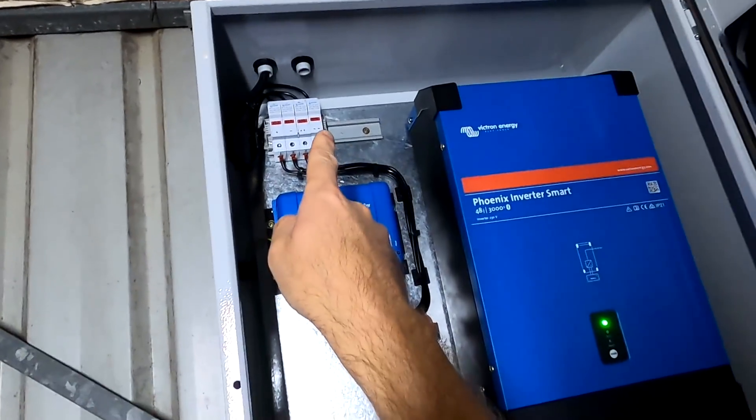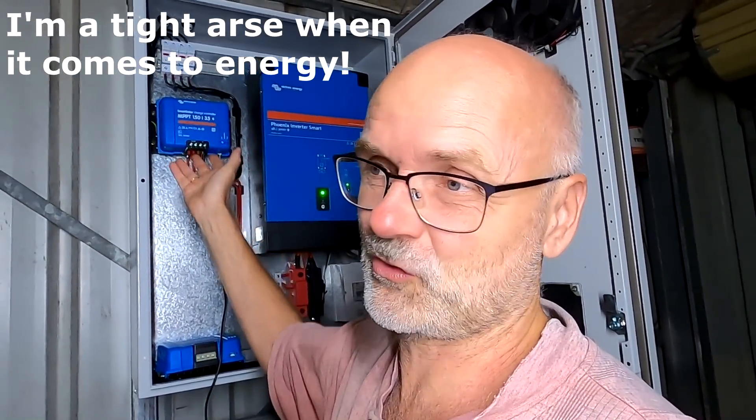I'm using the time now while the sun is not shining to replace the fuses with circuit breakers, for two reasons. First, during the day we've got 110 volts DC on these cables — I'd need to go onto the roof and disconnect the solar arrays, pull the MC4 connectors, before I could safely replace them. Second reason: I'm losing capacity, charge, and power during the day. It could take half an hour — potentially longer if we run into problems.